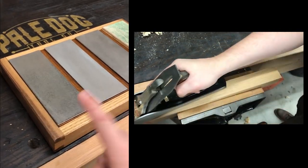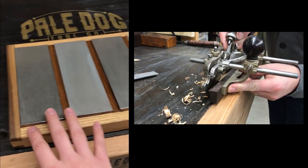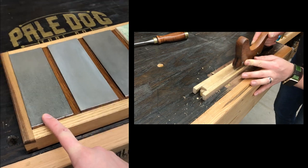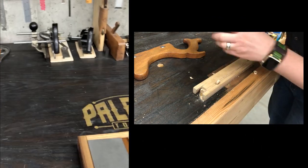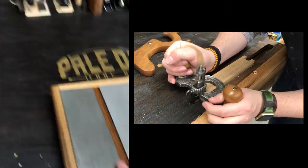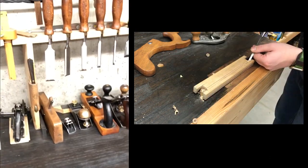First thing was the stop dado that holds that top board in all the way around. Stop dados on the 45 was really hard. And actually it took me three pieces, and then by the fourth one I had my technique down of using the 45 almost just as a marking gauge to establish where the dado would be, and then finishing it up with the router plane and the chisel.